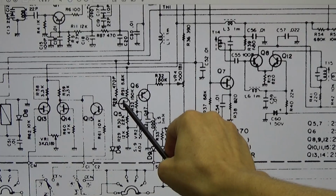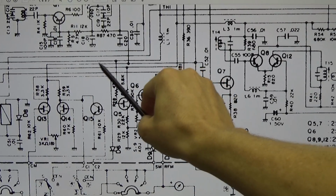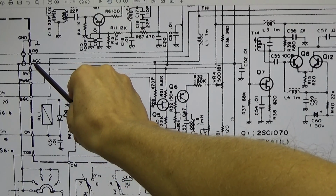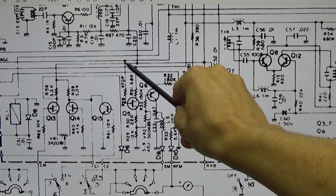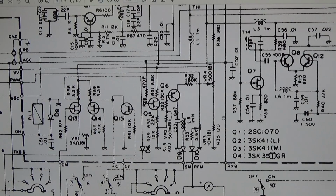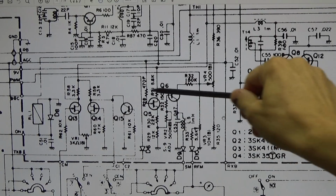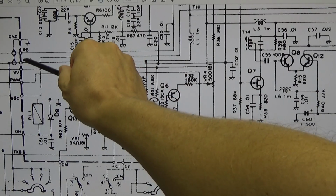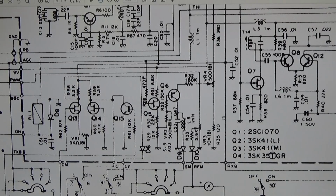And what we can easily see is that our buffer is connected to our AGC, so to our automatic gain control, right? That simply means we can measure our signal strength with the S-meter by using our AGC, and we can simply check our AGC and what will happen when we adjust our RF gain control, because then we must see our automatic gain control changing to another value. I mean, a positive or a negative value, as I said, depending on the design of our circuit.